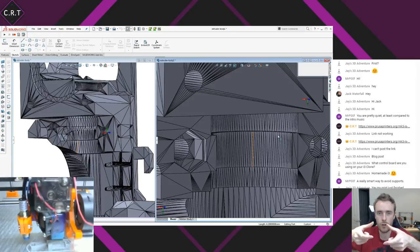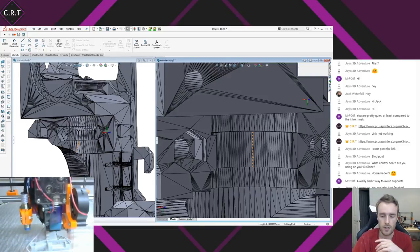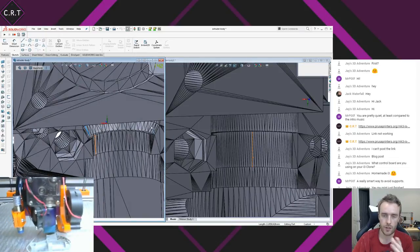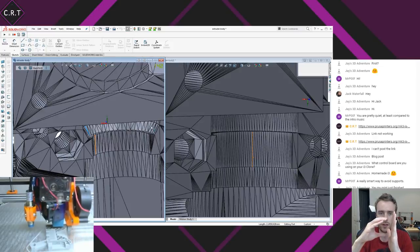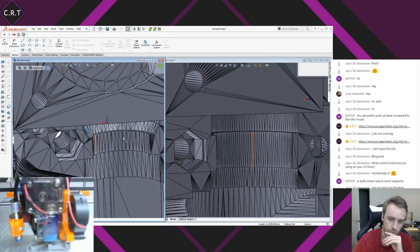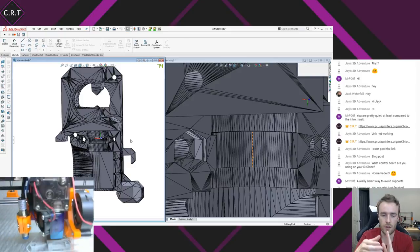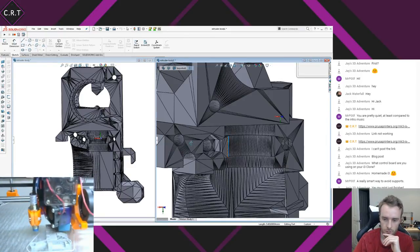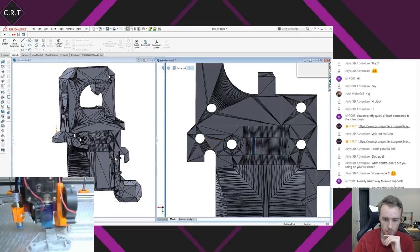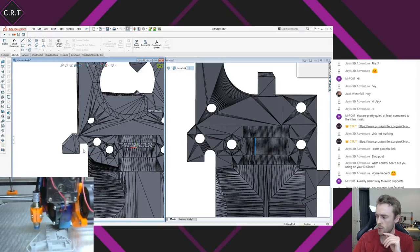But obviously, because you've got that cover coming over on the other side to hold it up, you don't need to hold it up on both faces. So it looks like they've added effectively a chamfer here, so that it's much easier to push in. It'll go in and then slide up, in that motion, as opposed to trying to wedge it in like that. And that looks like it'll make it a little bit easier to assemble. And obviously the cover then holds it in place. They've blocked off this bit a little bit. Maybe that 40mm fan has got a slightly thicker cable. There's a Noctua, so yes, there is.